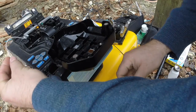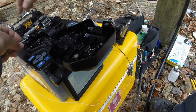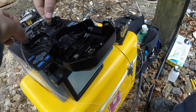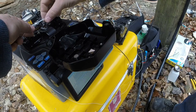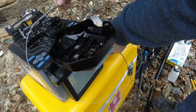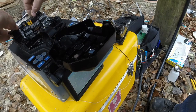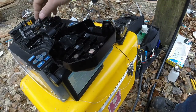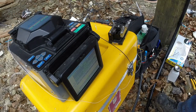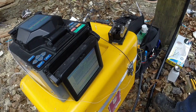So what we're going to do is slide the splice protector up to the join here. Carefully open that up — there we've got our completed fibre. Run that across, centre the splice. And then on the back of the splicer there we have an oven. Just drop the whole lot in there and push the heat button. What that's going to do is heat the heat shrink, shrink it down, and our splice will be protected. So we'll just wait a minute and that will be done.